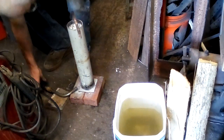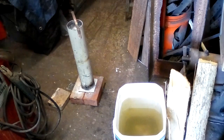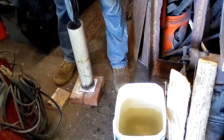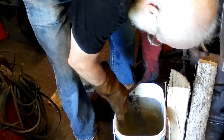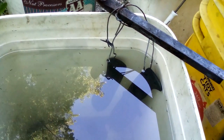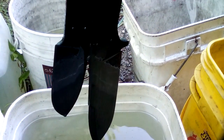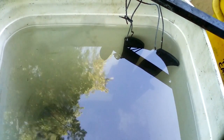After a couple of hours of cooking, I can turn the torch off. I'm going to take the knives and put them in cold water. After boiling the work in the phosphoric acid and iron filings, you put it in cold water for about ten minutes, which helps take the residual salts off. Then we're going to put it in some boiling water to really make sure we've neutralized the salts.